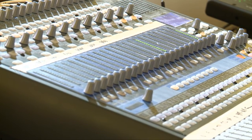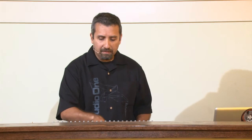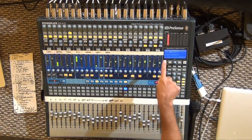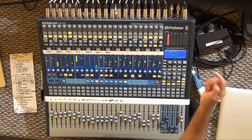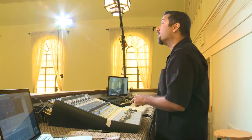One thing we included with the StudioLive is the ability to load presets very easily. A preset is a starting point — a basic EQ, compressor, and gate setting for any selected channel. Say we have a background vocalist on channel 17. I select channel 17, hit the load button, and all of my presets pop up on the screen. I select 'male vocal,' hit recall, and that preset loads to channel 17. From there I can tweak it and rename it — say, 'Jerry's vocal' — so whenever Jerry is performing, I can just select his channel and load it.